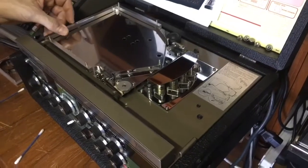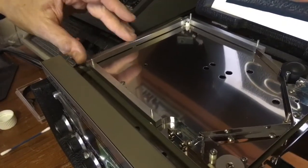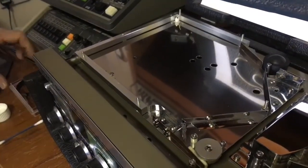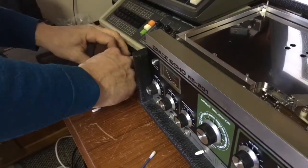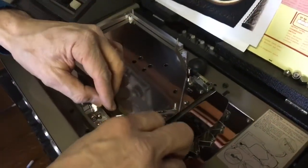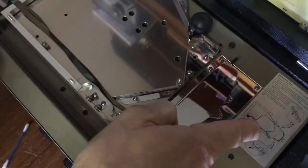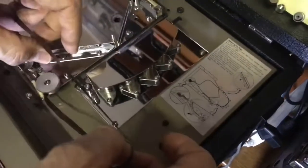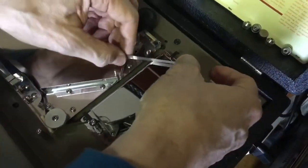Now, some space echoes have a trap door at the back to feed the tape through. This one doesn't, so it makes it a little trickier but it's still quite possible. Take the new tape — you can actually put the whole tape into the tray very neatly — but I'm going to demonstrate this as if you've got a long spool of tape, as it's the more difficult way of doing it. Carefully feed the tape in around the guides and around the heads following the diagram or the photo you took beforehand. Make sure the splice of the tape is on the outside, away from the heads. The splice is a small white or silver bit of tape that joins the two pieces together to make a loop.